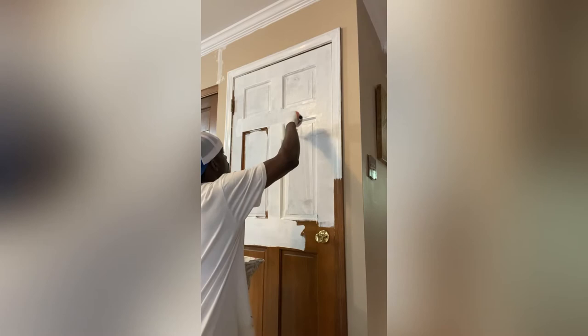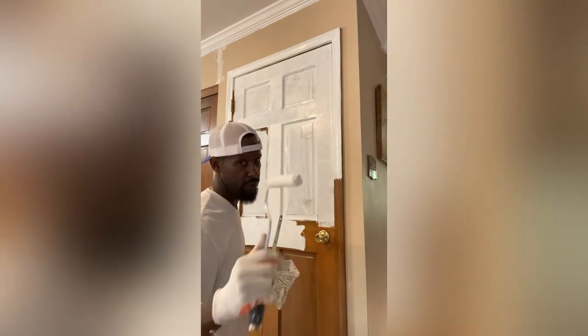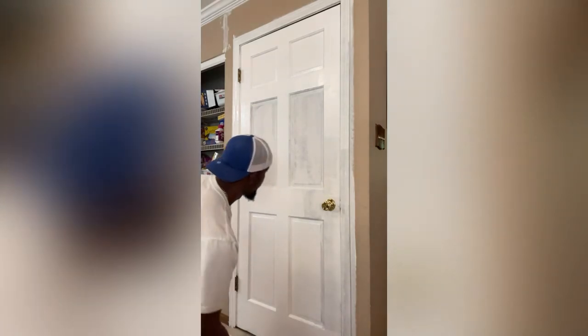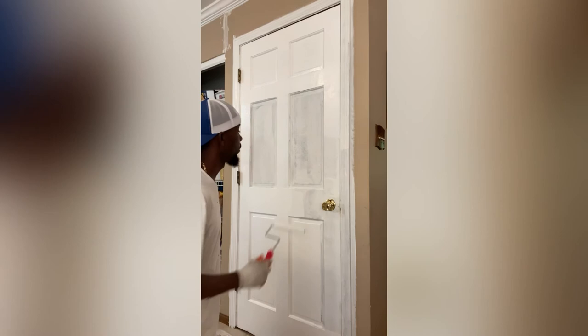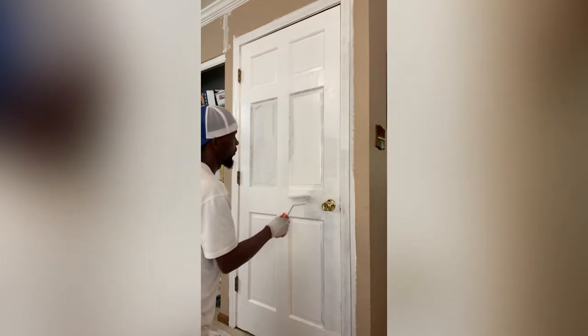So you can get in there. I'm going to get to a small brush. This is a finished roller now — a quarter inch for a finish surface, smooth surface. I'm going on with the second coat, actually the first coat of semi-gloss white, on top of the frame.